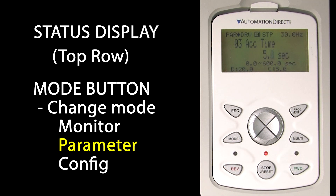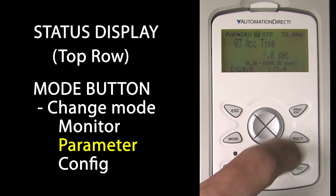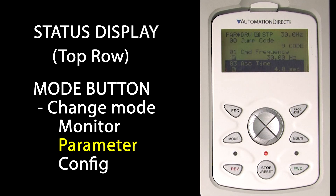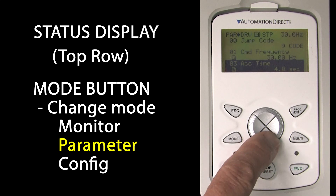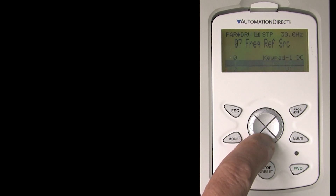I love this: I see everything I need to know about the parameter – the parameter number, name, value to edit, allowable range, the default value, and the current value. Left, right, up, and down arrows change the value, and enter to accept. Again, only one enter is required – the drive keypad requires two. If I go to the frequency source and hit enter, instead of range and current values, I see all of my options spelled out in plain text. I don't have to remember which number goes with which option. Enter to accept or escape to exit and ignore the changes.